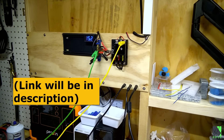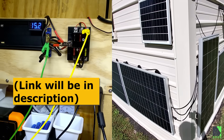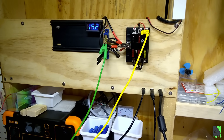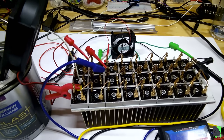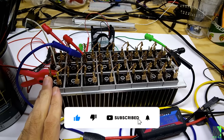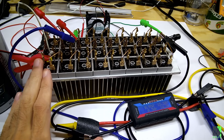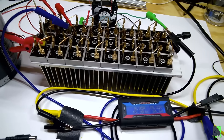Some of you have seen my Powerwall here that runs directly off of solar — this is not powered by a battery, it's just running straight off the solar. The solar panels on the wall of my workshop are typically 100-watt solar panels in parallel, so I have about 500 watts of solar into this wall to work with at any time if the sun is shining. Right now it's a bit on the early side and there's not a lot of power available. I'm now running this other diode-based heater I built — it's a prototype solid-state semiconductor diode-based heater designed to run off those 500 watts of panels. Because a lot of times, those solar panels just sit there and do nothing — they're just available for use, but a lot of times I'm not using the power, and I might as well make heat.